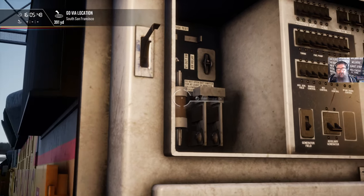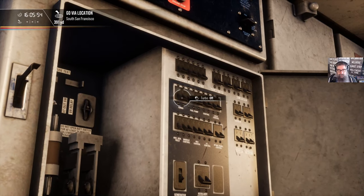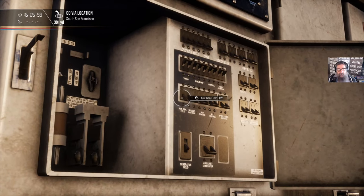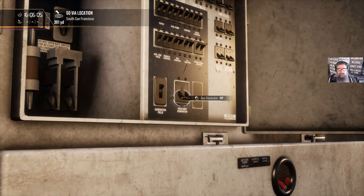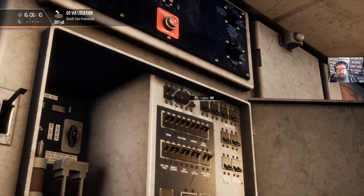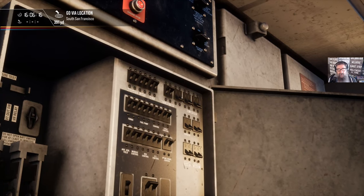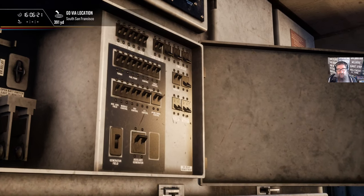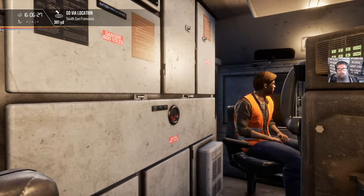In our fuse box, let's pop on our torch. We can see we want to put in the main breaker, inspect our fuses — they look okay — and the ground relay is also fine. Now we want to turn on everything that's in the black area. These are all mandatory to operate the locomotive — they're all the control systems for the engine and the generator etc. We also want to turn on whatever devices and other things we need: radio, lights, headlights, automatic drain timer — that's the air tank timer. We don't need heaters, it's California.